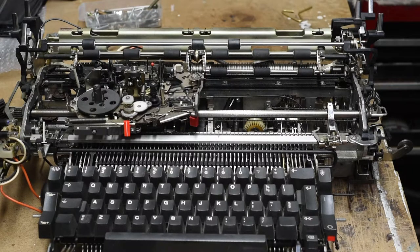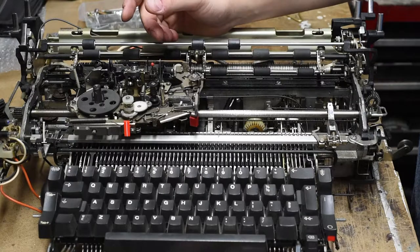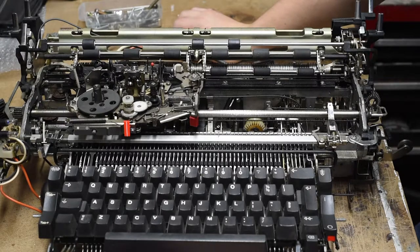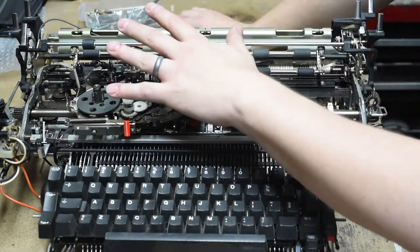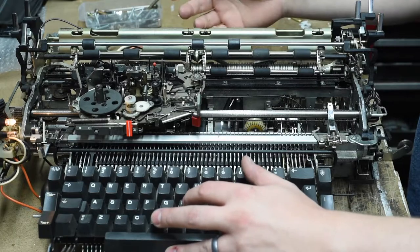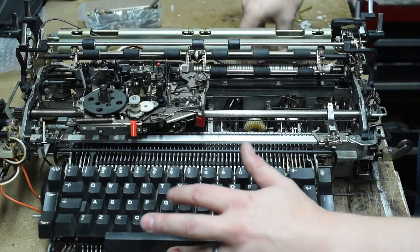One thing I've learned is how to half-cycle the Selectric. When I receive the rotate tape — which I've ordered from a place in Montreal, hopefully it ships soon, this time I ordered the correct 15-inch tape — I'll need to install it, and to do that you need to half-cycle the machine. A half-cycle means you're manually working the mechanism by hand instead of having the motor do it. If I turn it on and type a letter, that's a full cycle: the head moves forward, advances a space, and so on — all because the motor is running.